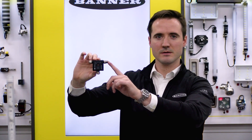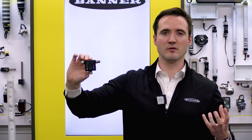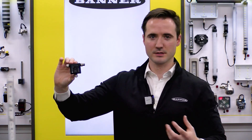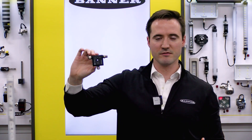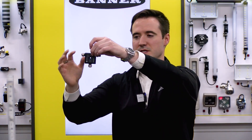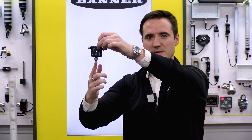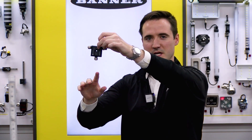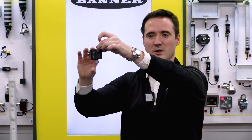On this IO-Link port right here, there's an additional pin for PFM, and that's going to be very powerful for retrofitting existing analog applications with lighting products. The way you do this is connect this to your IO-Link master, configure the device for pin mirroring. You take in your analog signal — a 4 to 20 or 0 to 10 volt signal — and set it up to pass that signal through to the other port. That's called mirroring.